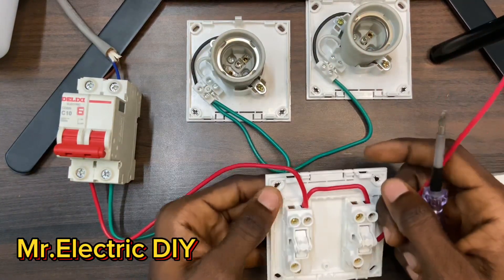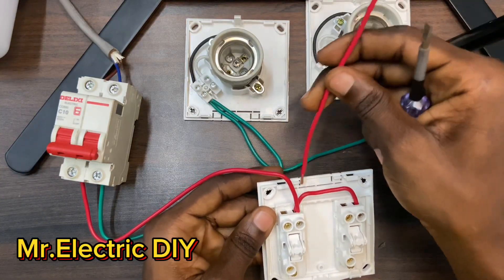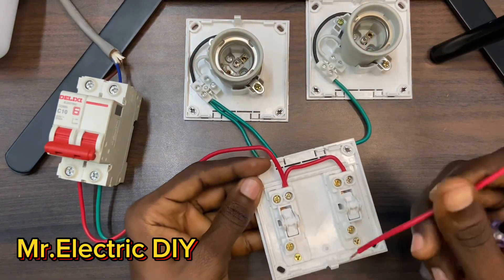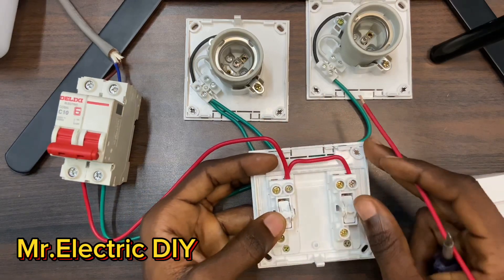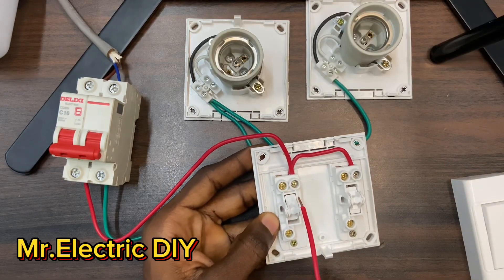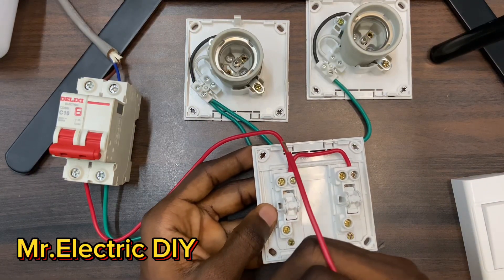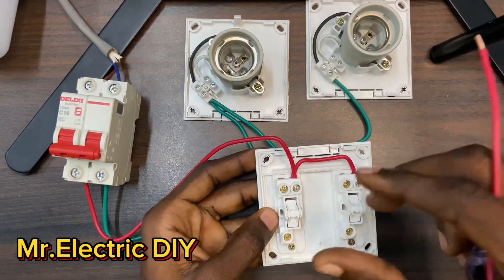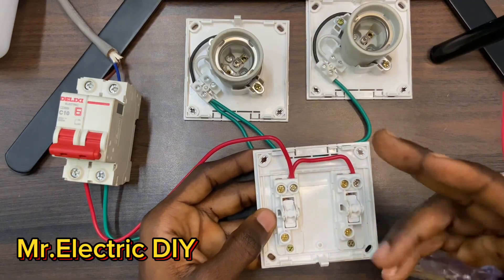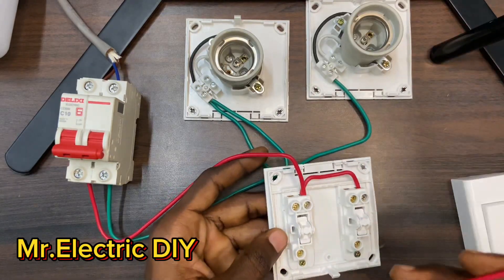This red cable is going to be the switch wire for this lamp. What I will do is connect from L1 to the lamp holder. You can also use L2 — the only thing that is going to happen is the switching position is going to change. If I use L1 and turn on the lamp it looks like this, but when I use L2 it is going to be like this. You can use L1 or L2 — only the switching position changes.